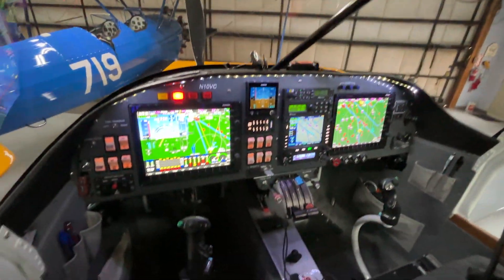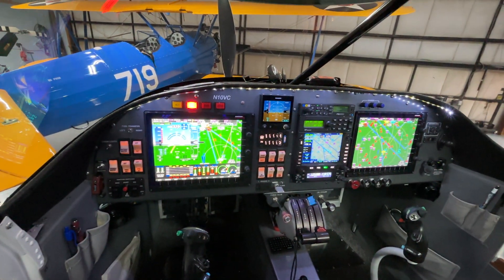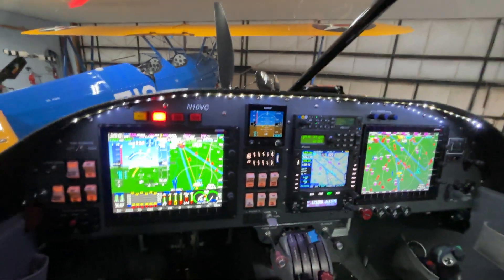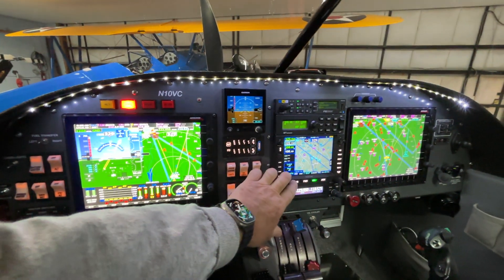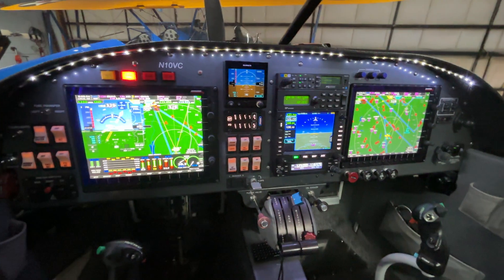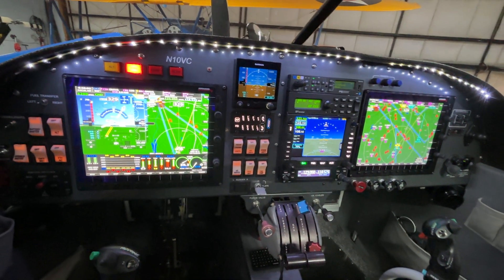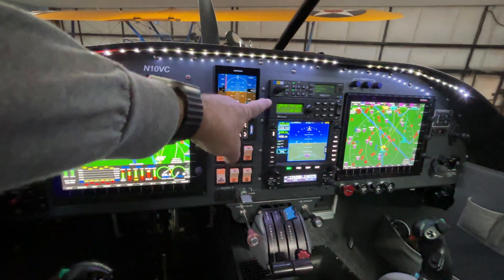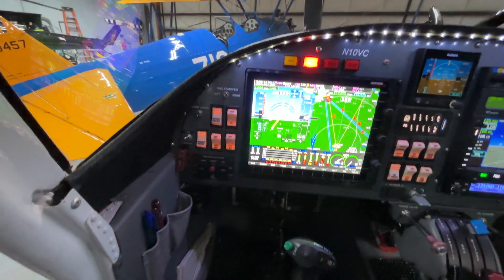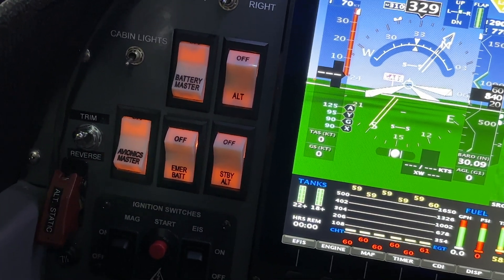Now we'll turn around and show you the coup de grâce — this is the instrument panel. It came out really, really nice. We've got two of the Advanced 6600 screens left and right, and the navigator is an Avidyne 550. We've got a lot of backup: a G5 backup, and the 550 also has its own attitude backup. I put a backup battery in there that will power the screens and everything on the bus — the engine gauges, the autopilot, etc. — all on a backup battery. We've got a TrueTrack autopilot; the Sorcerer had that since day one and I really do like that autopilot. Everything is dimmable. I put switches on the pilot side that I didn't want anybody else bumping in flight — the master for the avionics and battery, along with both alternator controls.